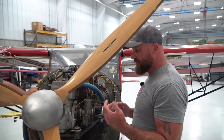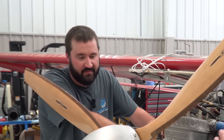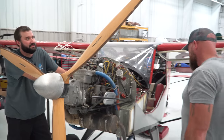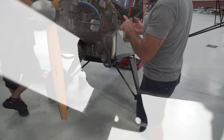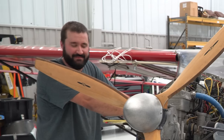What I want to start with is the worst thing. You have no safeties holding your landing gear on right now. You can go down there by hand and take all the hardware out of your landing gear. Basically on all the landing gear there's no safety wire, not a cotter pin in sight, nothing's torqued — no pins, no torque, nothing.